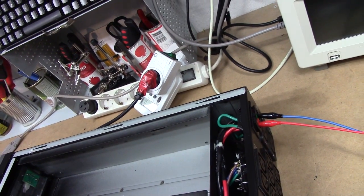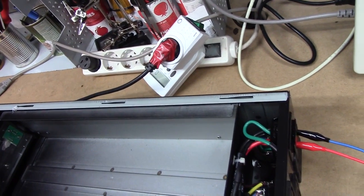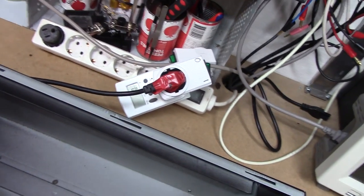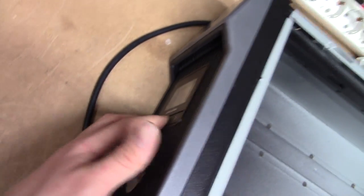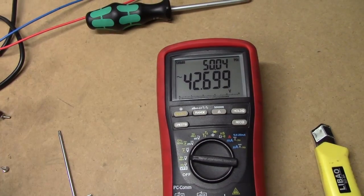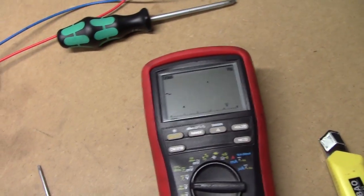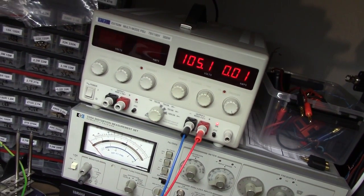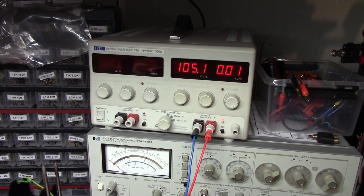So I'm going to try the work of art, which is trying to quickly disconnect my power supply in case the battery charger isn't isolated, and flicking the switch. Doesn't seem to be doing anything though — it probably needs a battery. So I'm going to have to check if the battery is live. While we do have some voltage between the battery negative and the case of the unit, this is definitely not live territory. Best thinking is it can handle 300 volts peak to ground, so since the European grid peaks at 325, it wouldn't be a nice thing to do to connect that to a floating ground connected straight to mains.